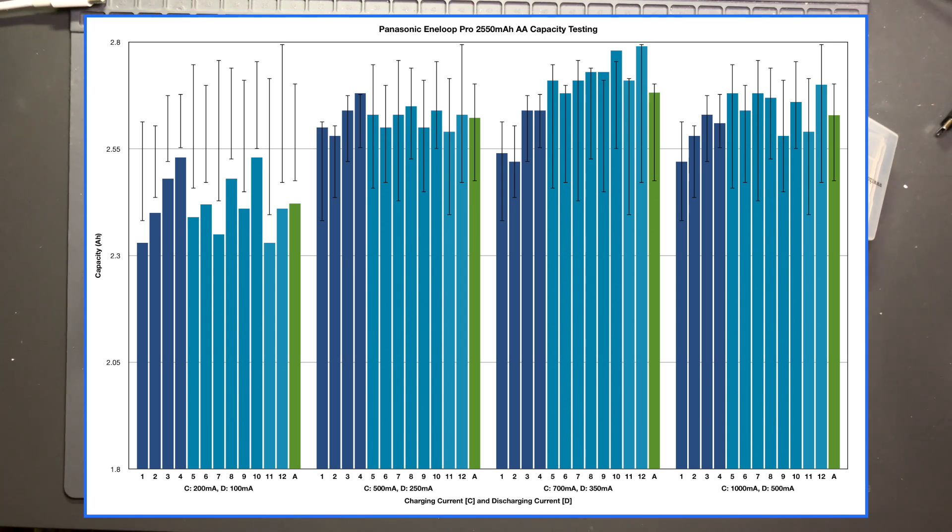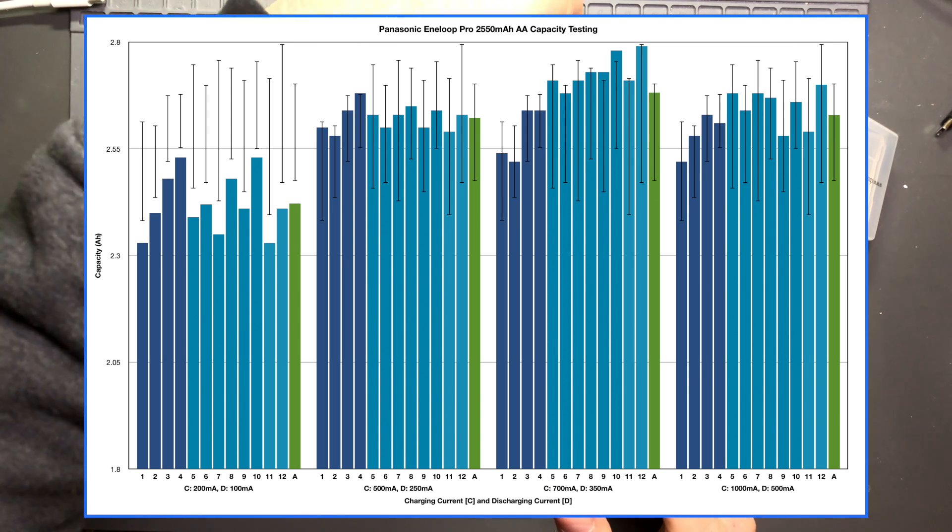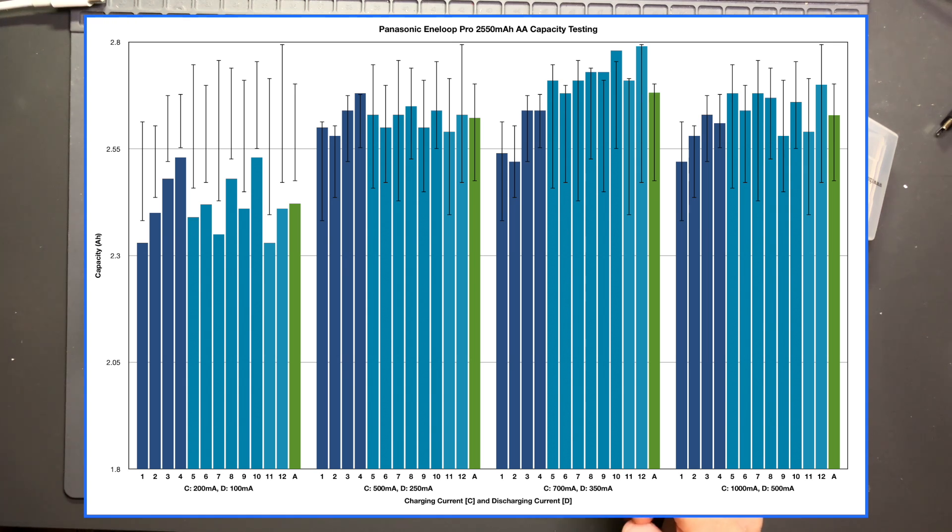These are really great cells. What impresses me most is not just that they're meeting the 2.55 amp hour capacity — where many other cells we've tested have not even met that level — but that they exceed it by a healthy margin even at higher discharge currents. Even at lower discharge currents they still do a pretty good job. If you're looking at the pricing and thinking these are so expensive, it's for a reason — they really do perform well. With a sample size of 12, that's a statistically significant set rather than just testing one cell and concluding it's fine, because one cell might be the best or worst in the group, or maybe it wasn't cycled enough.